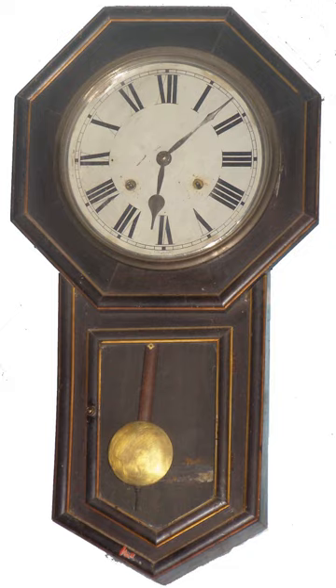In most pendulum clocks the rate is adjusted by moving the bob up or down on the pendulum rod. Moving it up shortens the pendulum, making it beat more quickly, and causing the clock to gain time. In the most common arrangement, the bob is attached to the pendulum with an adjustment nut at the bottom, on the threaded end of the pendulum rod. Turning the nut adjusts the height of the bob, but some bobs have levers or dials to adjust the height. In some precision clocks there is a smaller auxiliary weight on a threaded shaft to allow more fine adjustment. Tower clocks sometimes have a tray mounted on the pendulum rod, to which small weights can be added or removed, to adjust the rate without stopping the clock.